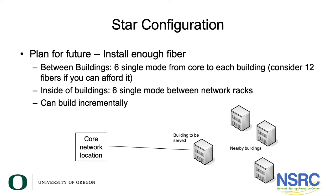One trick to reduce costs is to run a large fiber cable — for example, a cable with 144 or even 288 fiber strands — and then splice onto that large cable to run smaller cables to surrounding buildings where that cable ends.